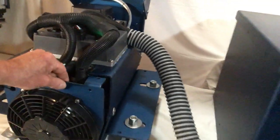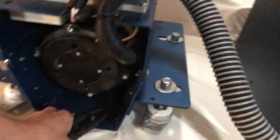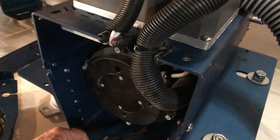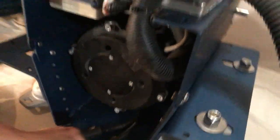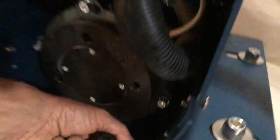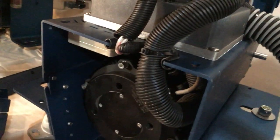This is the controller. We use the Sevcon controller — just an amazing company to work with, very reliable controllers, really incredible equipment. We're going to take off our SPOW fan here. You'll notice it's hooked on with two waterproof fuses. If I open one up here, you'll see inside the fuse — these are ceramic body fuses with a rubber boot on it. There's a spring inside there so that fuse is always in nice contact with the wires.